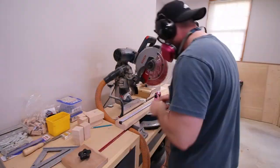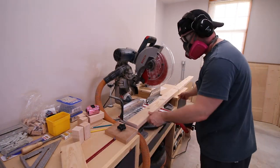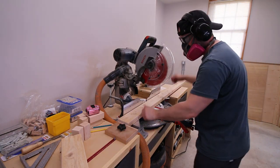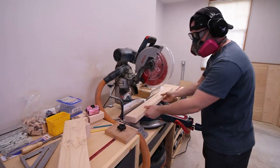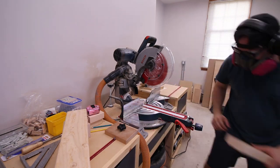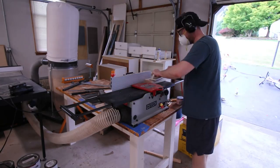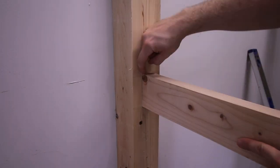Next, I'm cutting to length my support 2x4s, and this is what's going to hold the wood. Using my new stop-lock system, and it's working. I wish I had made a longer miter table or an extension — there's not a whole lot of room where I'm at right now, but hindsight's 20-20. I'm jointing my 2x4s to make them a little bit more narrow, because the sandwich holes were just a little too tight. Back to the jointer.